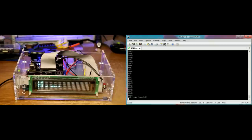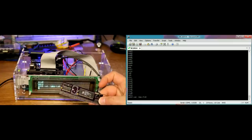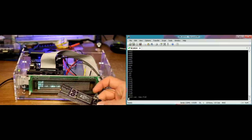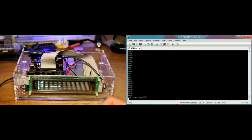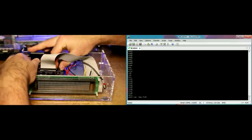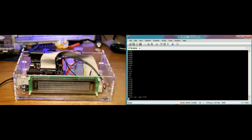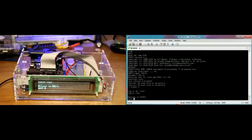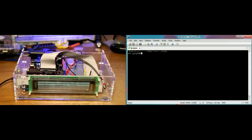So what we will do is install - I covered this some time ago, many videos back - a CTC board. The CTC board will generate interrupts, and those interrupts will wake up our sleeping processes. So let's shut this down, plug in the CTC board. Now if we cat dev fd0 we can see it is printing out stuff that's on the floppy.